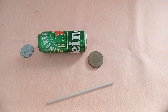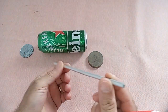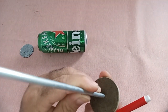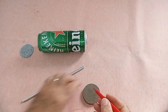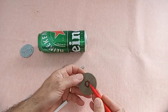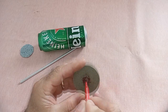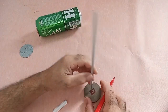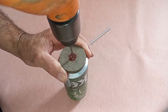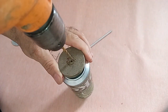On the insulating base we will place one of the radiating elements — an aluminum or copper tube with a diameter of four to six millimeters and a minimum length of 20 centimeters, which will later be cut to the antenna's design size. This tube is secured in the center of the insulating base using a one-half inch long wood screw. Use the drill to make holes at the ends of the aluminum or galvanized strips, and make corresponding holes in the soda can, ensuring they align with the holes in the sheets. Ensure to follow these steps carefully to ensure a precise and secure assembly of your antenna.